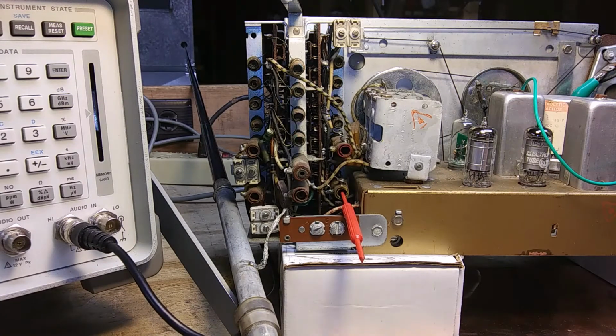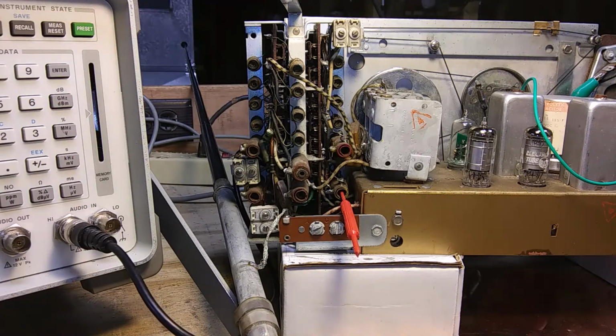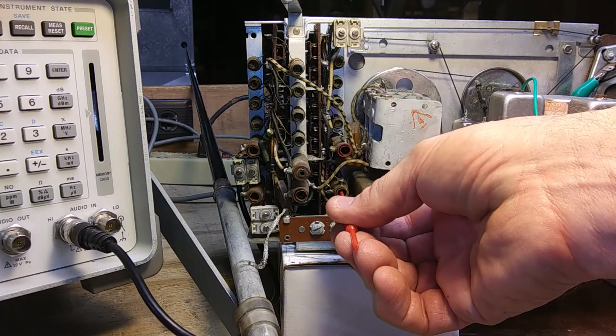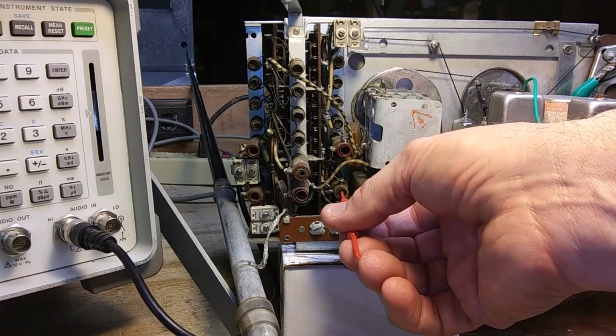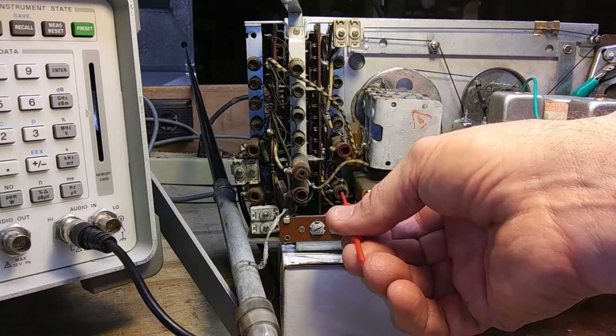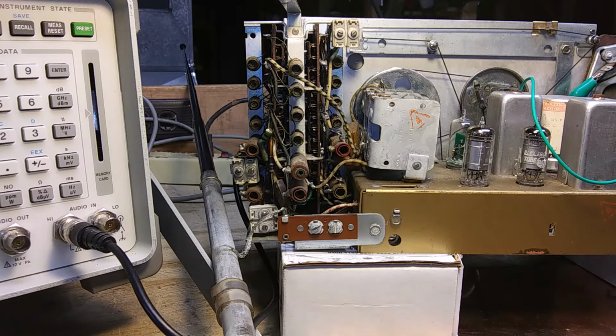Okay, I got the signal generator set to 4200 kc, the radio set to 4200 kc, I have the tool into A12, and it's off frequency. Okay, that's A12. Okay, so off camera, I went back and readjusted A9, A10, and A11. And then I did A12 again. Now it says keep it at 4.2 megacycles and adjust A13 and A14 for maximum output, and then repeat.